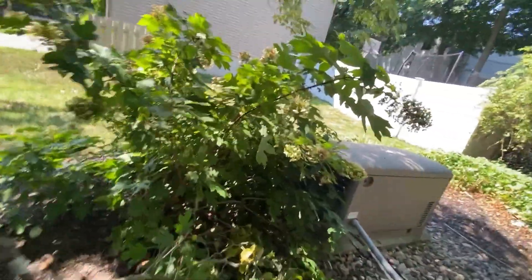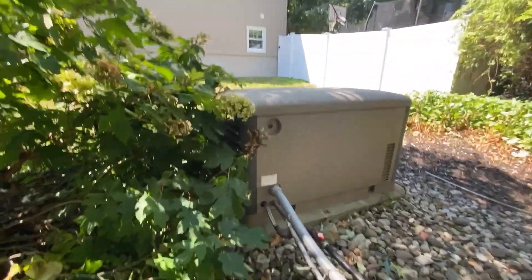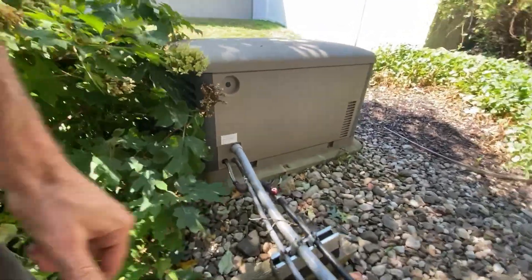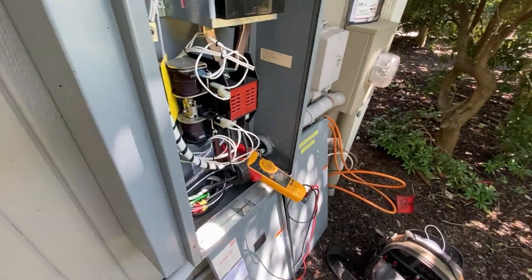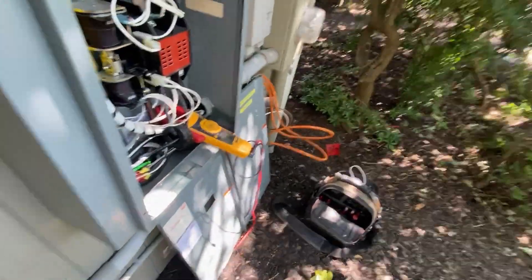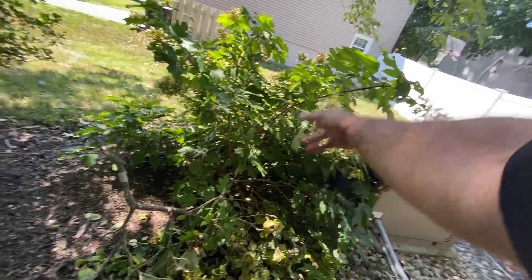Generator — whoa, that's not good. It sounds almost better when it's open so it can breathe. I've got to let the homeowner know they need to do something about that — you can hear it's starving for air, making it hunt. Instead of wasting time, I'm going to find the homeowner and tell him he's got to chop this vegetation away. The switch-back could happen any second but this overgrowth is bothering me.